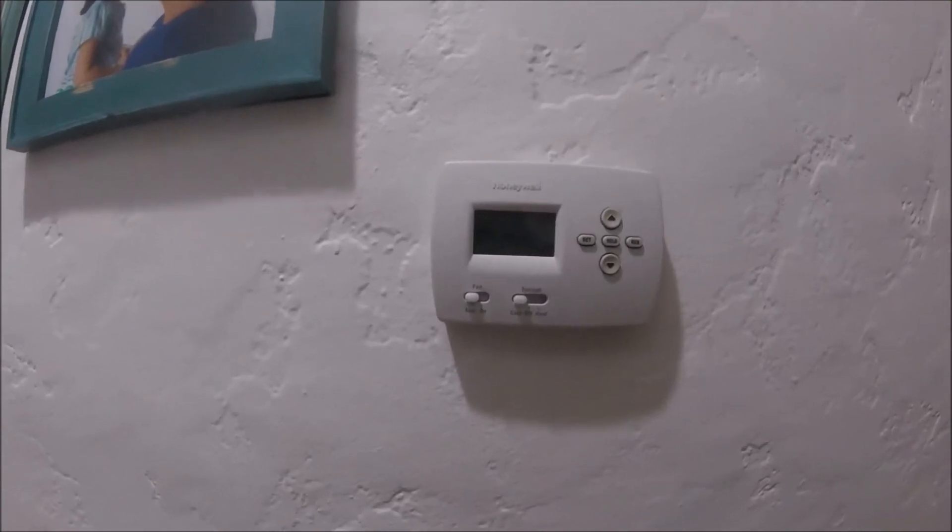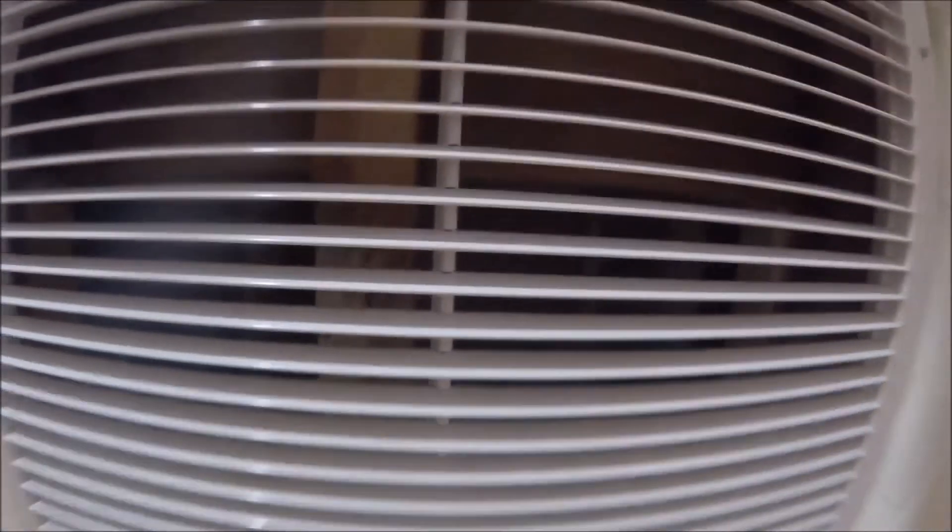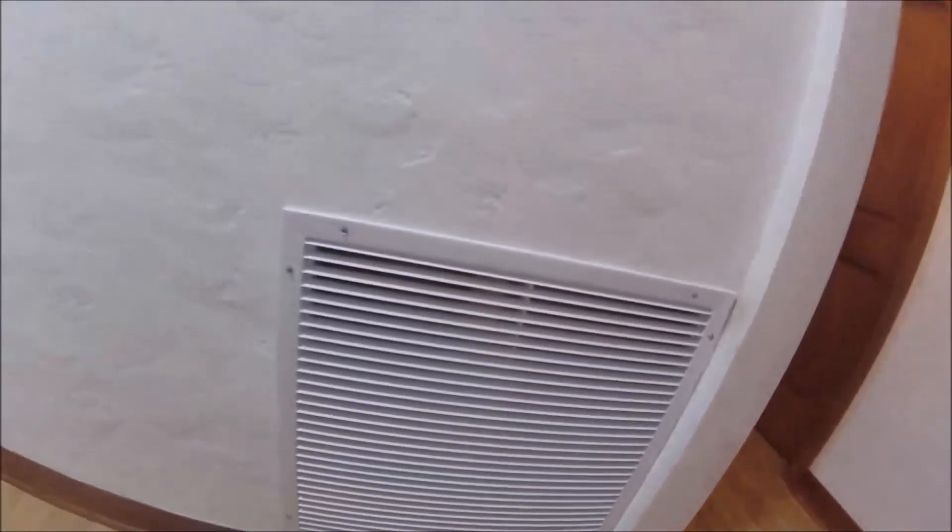And your new vent pipe — double wall, no single wall. I put a trap with a union and a safety overflow switch, new transformer. I just turned it on and it's already dropping temperature. Get real close and you can actually hear the sound of air getting sucked through it. The customer noticed increased airflow to his daughter's room — he said there was hardly any before, and now it's a significant difference. Hope you guys enjoyed the video; please don't forget to like, subscribe, and comment — I love comments. Have a good one.